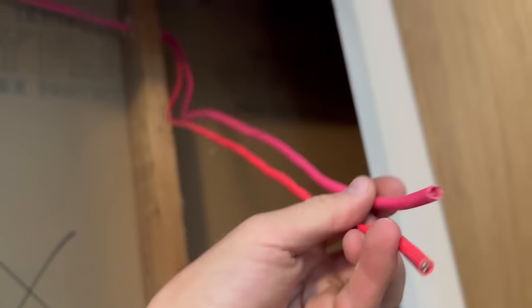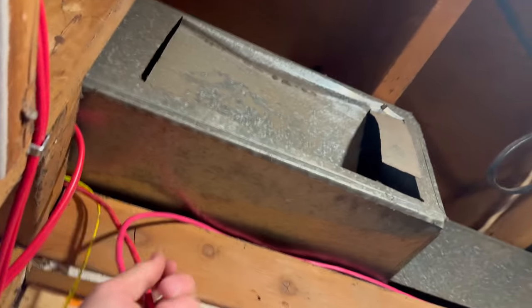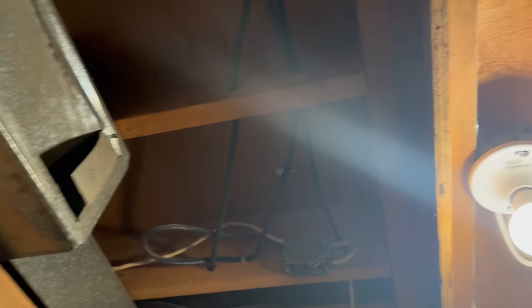Okay, here we go. This is the front door light switch. So the pull station will be lower and probably right about mid here. So I've got our two, three wires. Well, actually one's a four wire, I think. Ran through here, down, through all of these joists. As you see, there's a lot of extra. So it goes in up there and it runs through in there, all the way down. So I'll staple it up nice over here. And I might leave a little bit to be able to cut it somewhere if we ever wanted to add any more devices in here. If we leave enough for a box, we'll coil up maybe 2 feet of it.